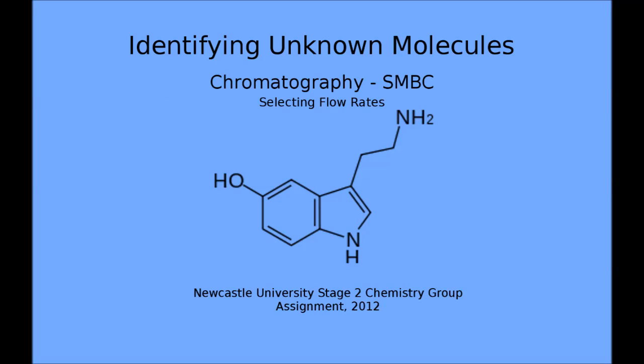Correct selection of flow rates is key to the success of this technique. The extract front between zones 1 and 2 and the raffinate front between zones 3 and 4 need to be stable but still allow separation to occur. If a trial-and-error approach is applied to this selection, as is done for other chromatographic optimisation, you are likely to not succeed. Simulation using computer software is essentially the only way to get it correct in a reasonable amount of time.